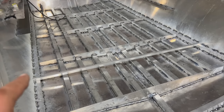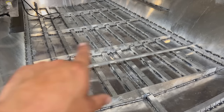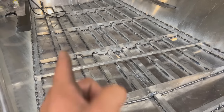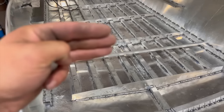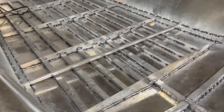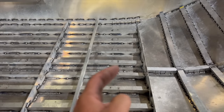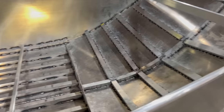That's just angle aluminum. And then the floor, every 12 inches, will run one of these. And then I will run, maybe not every 12 inches, maybe 16 inches, I'll run connecting. So it's gonna end up being a big grid all the way from just in front of the front deck, back. Because in front of the front deck, say the front deck was here, I need a little area for storage and primarily for my batteries for the trolling motor. So that's what we're gonna do.